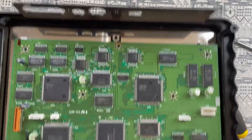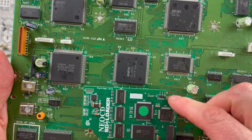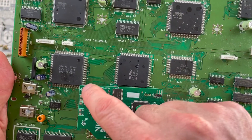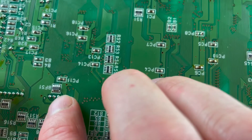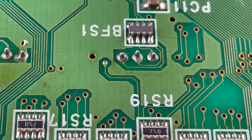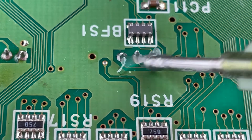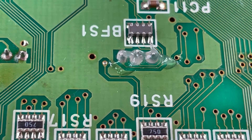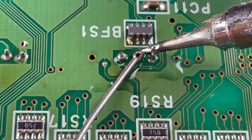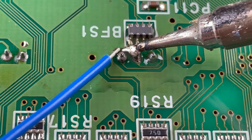So here we are down to the motherboard of the Neo Geo. First things first, the main mod board clips firmly onto the CPU like this. Then I need to move the CD connector to the correct position. Flipping the board over, you can see these three pins which is where we need to solder the wires that then connect to the board.